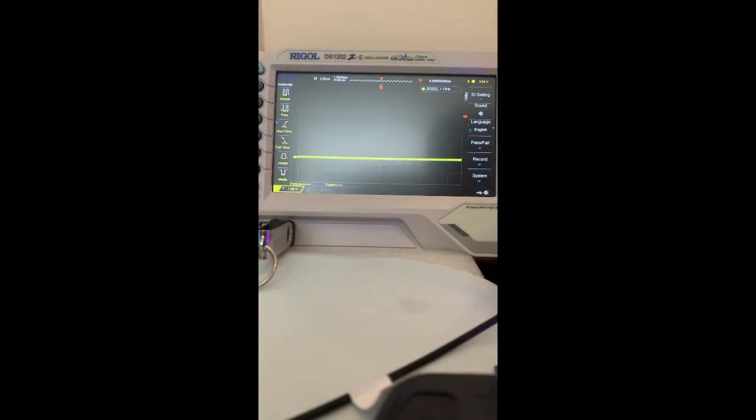So just to test if the inputs are working, on the input side of the LS157, if I put the probe on pin 2, and you can see it's high, this is the trace for the fire button. So if I press the fire button on my control pad, you will see as I press it, it goes low, which is what it should do.